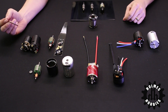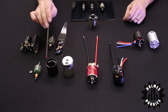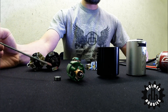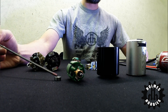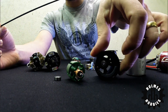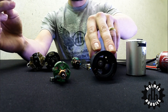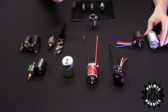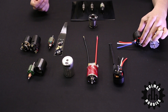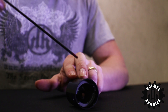The common parts for brushless motors and brushed motors include the housing, and they also have a shaft which delivers the power to your pinion, and then bearings which the shaft rides on. They also have magnets in various configurations. Brushed motors will have the magnets attached into the can, whereas brushless motors will have the magnets on the rotor on the interior. The magnets can be on an outer rotor, but the function is the same as an inner rotor motor.